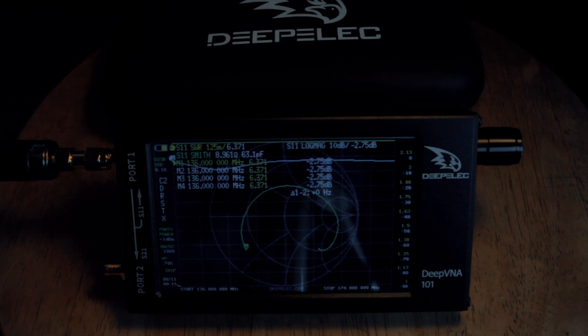In my opinion, when creating antennas this is a must. I suggest not using only a common analog or digital SWR meter, as the data it shows is limited. The SWR meter — analog or digital — is better used as a guide or monitor when transmitting, set up with your home base or mobile radio to monitor antenna performance and protect your radio.